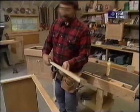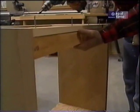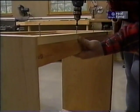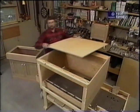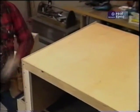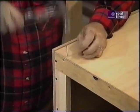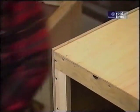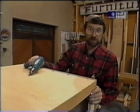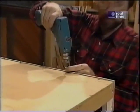Now I want to install this little cleat along the back edge of the top frame, and ultimately that'll be used to fasten the dry sink to a wall. The back of the dry sink is nothing more than a piece of quarter-inch Luan plywood, fastened at the top and the bottom with some five-penny nails into the pine. And on the sides, where it would be real difficult to drive nails in the oak, I'm using screws, being sure to pre-drill some holes.